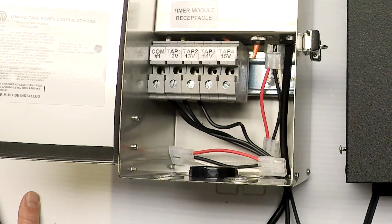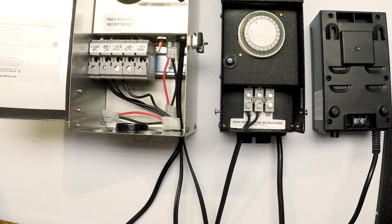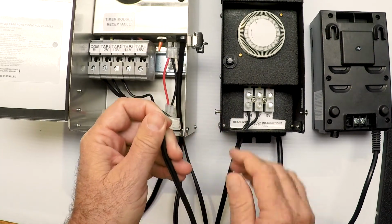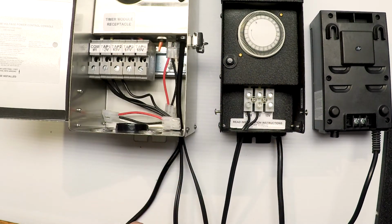And it's 12 volts coming out, and you're not going to hurt yourself with these. And if you do cross the wires out in the field, you know, the ends or whatever, you're going to get a dead short. You're going to have to reset your transformers. And there's a reset here and a reset down here on the bigger ones. The little ones reset automatically once they're unplugged.